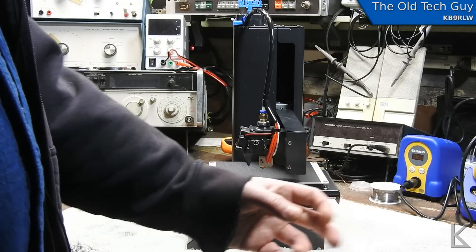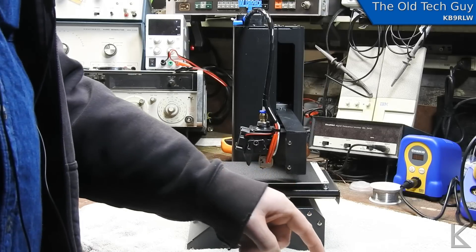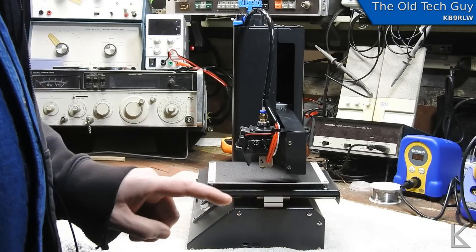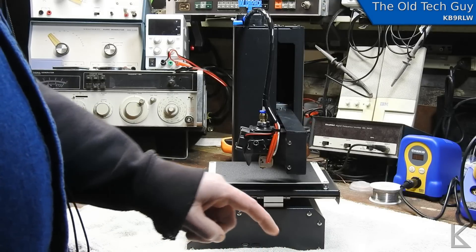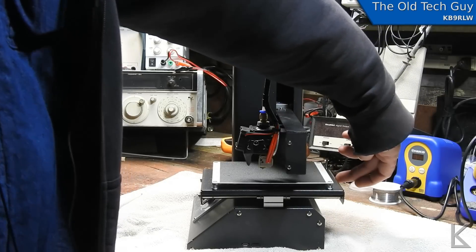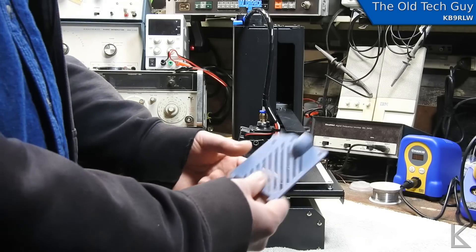Obviously what the designers did here is they wanted the printer to have a small footprint and be nice and complete looking — no external cables running around. So underneath here they have the two sets of wires that go to this bed curled up and bound to give them some room to flex. That's an awful lot of flexing going on. The wires where they go through a grommet into the case are being pulled in and out of the case by about an inch and rubbing against that grommet. To me, that is a point of future failure.